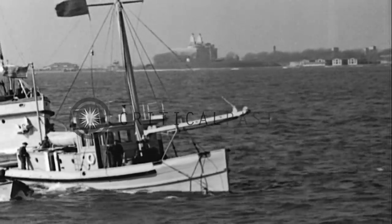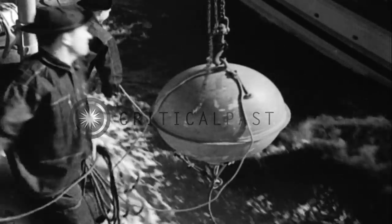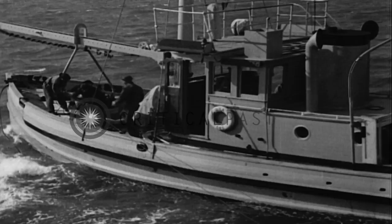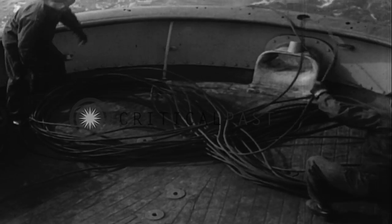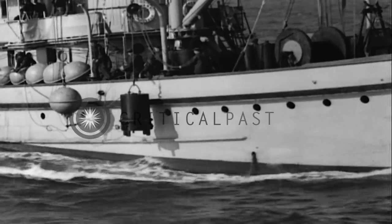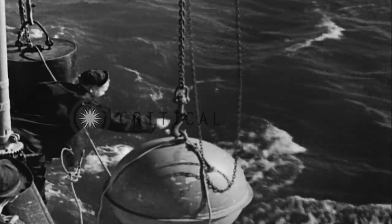The planter approaches the DB boat, this time on the opposite side. One of the two heaving lines attached to the cable with a clove hitch is thrown to the DB boat and the cable end is quickly pulled aboard and made fast. As the planter proceeds toward the line, number 9 cable is paid out over the stern. As the mine planter nears the line, the command "stand by" is given, and the locking pins are removed from the trip hooks.